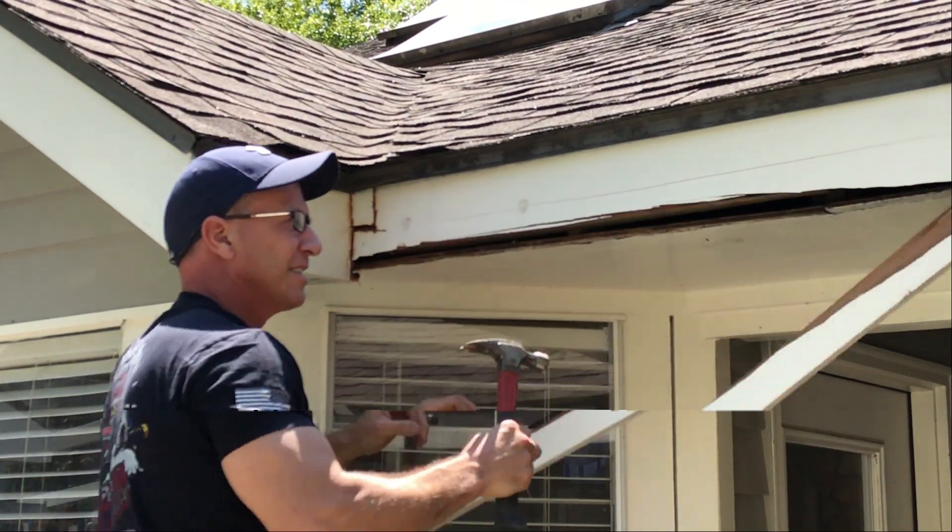See how this baby fits. As long as I protrude a little bit past that fascia — an eighth of an inch — I'm good. So I'm only going to tack one tack over here because I want to be able to move this; I'm not exactly sure if it's square. One shot, that's all I need — we'll get another measurement. 54 on the money. You want to have a block in there to make these things meet, tacked to this board and here, so when I butt the other one up to it I'll have a nice tight seam.